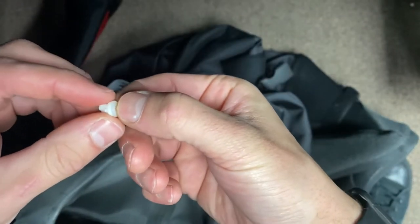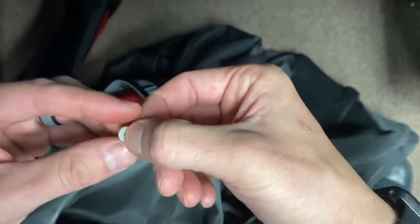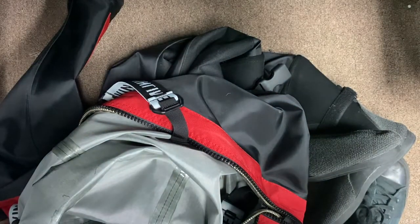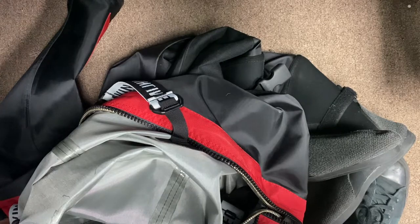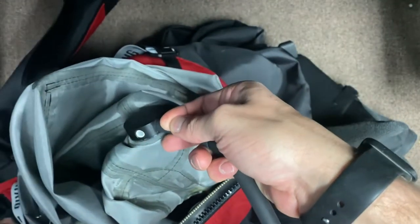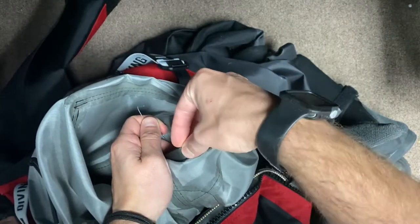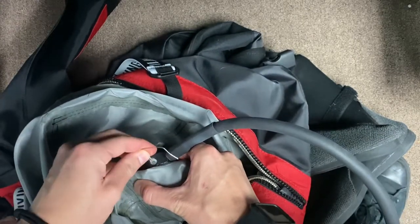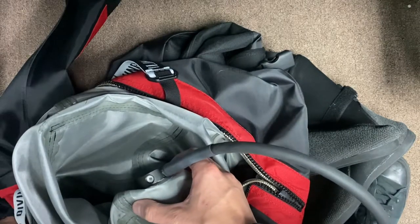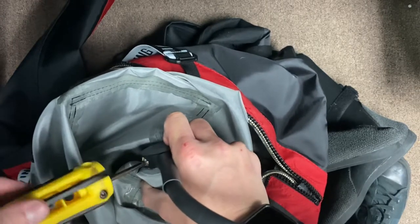Just to show you how this is going to be sitting in there: I've got my lipped edge mating up with that duck bill, and then the flat surface is going to be mating with the set screw. Get our new duck bill out of the package — we're going to drop him in, being really careful not to damage it. Drop the little washer in place the correct way, everything's lining up nice. Get our set screw, and again, you don't have to go crazy tight here — you'll only cause more problems if you do.